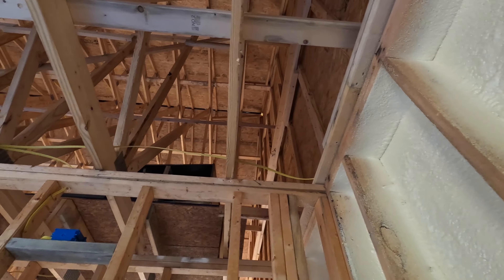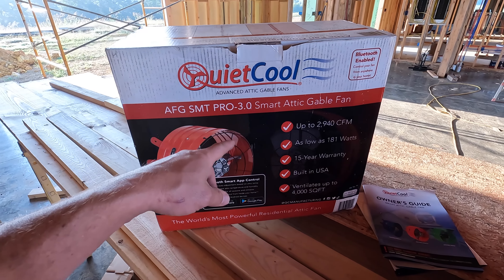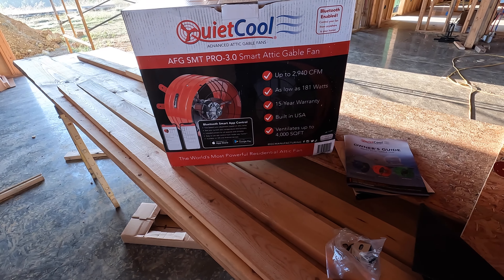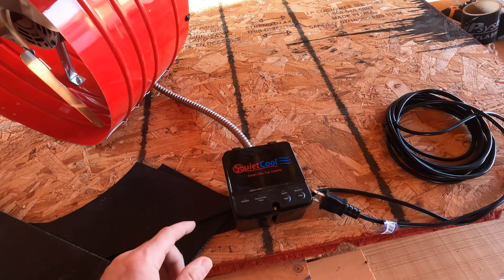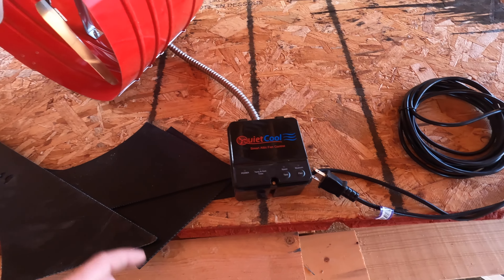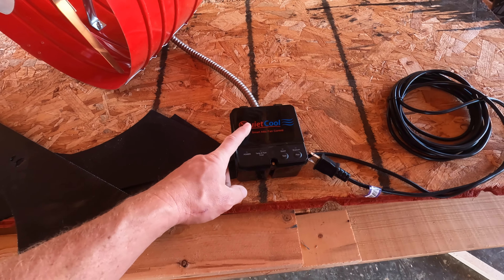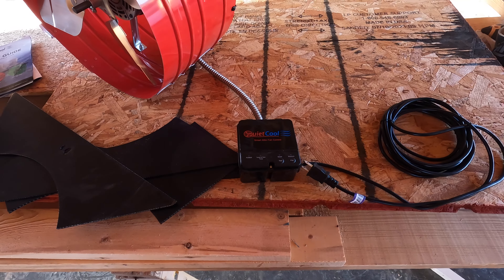We'll figure out a way to get a platform in there to work off of. Here's what I'm putting in — these are from Quiet Cool, rated up to 2,940 CFMs and ventilate up to 4,000 square feet. These are Bluetooth compatible so you can link your phone and operate it from anywhere in the house. They've got a little control unit with a thermostat, so if you want your attic to get above say 100 degrees, you can have the fan kick on to bring it back down. We should be able to pull a lot of heat out and keep it from being so hot — so you're not trying to overcome that 130-degree temperature above you in the attic.